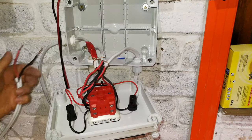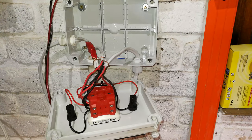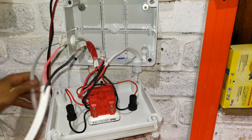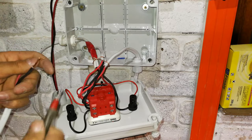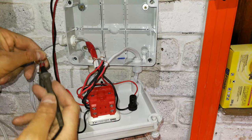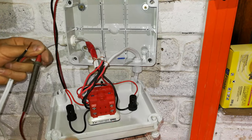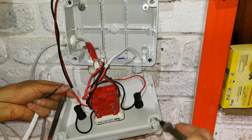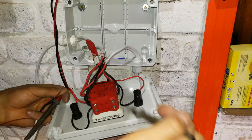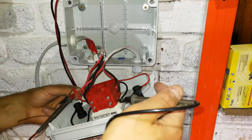Right, I'm going to demonstrate it and check it twice. This is the first check. What I'm showing you here is the other side of the load cable. There you can see the load. Now, I'm going to first check whether the live and neutral are touching. They shouldn't be. That's correct. Now, I'm holding my finger on the live, and I want to see if I connect it to the generator, whether the buzzer will go, telling me that I'll be getting my supply from the generator side.